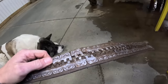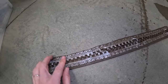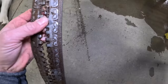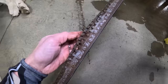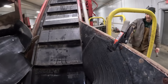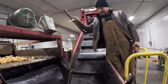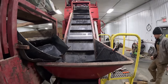Now that you've seen the new lacing in here, I'm going to show you the old lacing up close. On the backside, you can see the little staples that were folded over — they are nice and flat and don't catch up on anything. The cable is still intact, but the teeth have worn out in between. I'm going to turn it on now and see how that belt tracks — just verify that nothing got left on the belting. Feels pretty good tension — let's turn it on and see how straight it is.